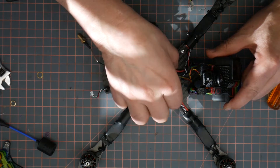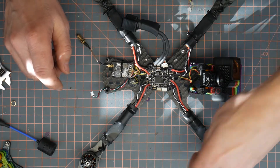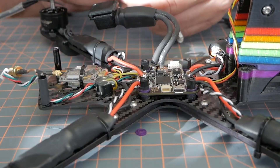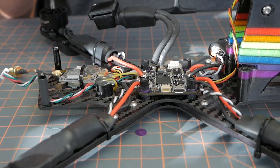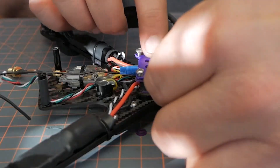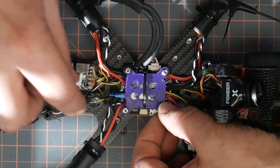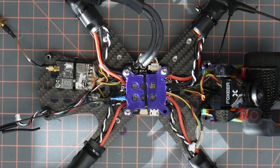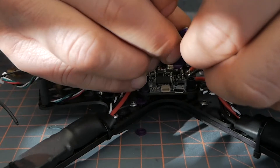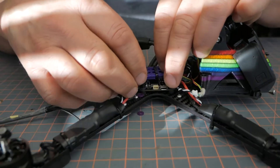The flight controller is still well dampened and unaffected by it. That's the setup, and putting it back together is just the reverse. The reason I mounted the receiver upside down — you can mount it right side up, but upside down, nothing is going to catch on the battery straps. By keeping it facing down, you keep it away from the battery straps, and that was one of the things I wanted to avoid — snagging things. It goes back together like that.